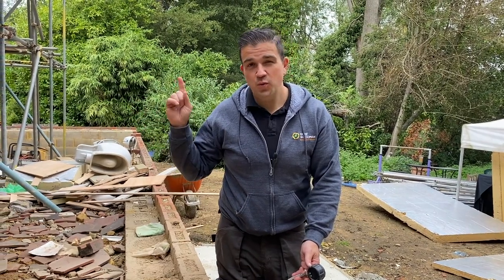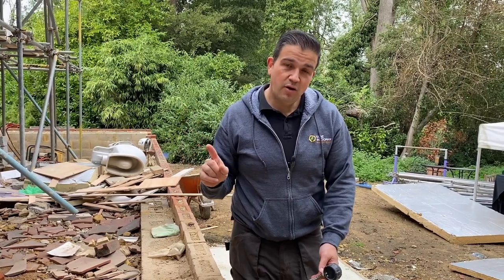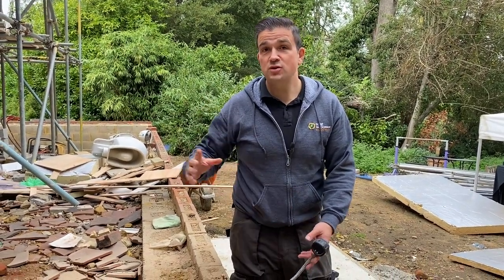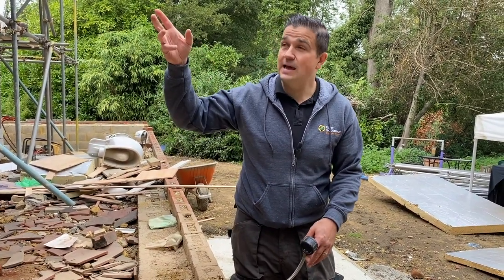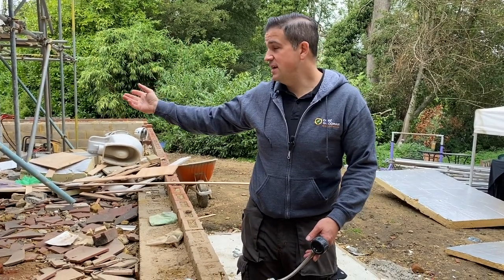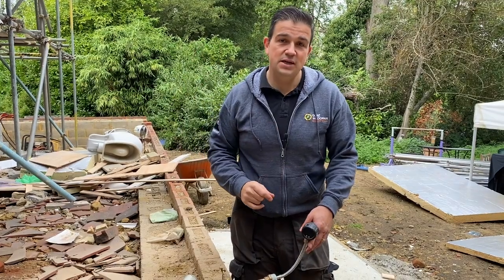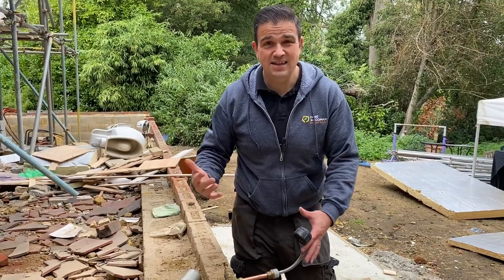Okay, so as I said before, we've got a 20mm supply coming into the house, and actually the flow rates and the pressure behind it aren't too bad. But it's really when you're using multiple outlets that the problem lies. You might turn the tap on in one bathroom or have a shower, then you come downstairs to use the kitchen or the washing machine comes on, and then you see a big diminish in what we've got coming into that shower, and you start getting frustrated.